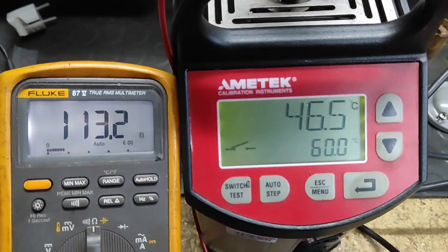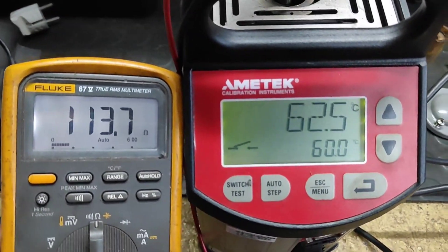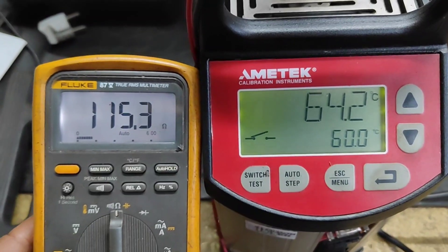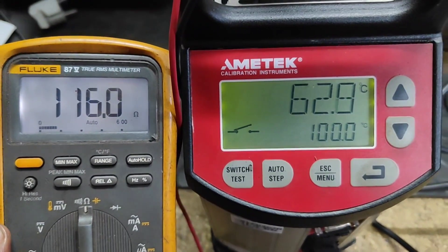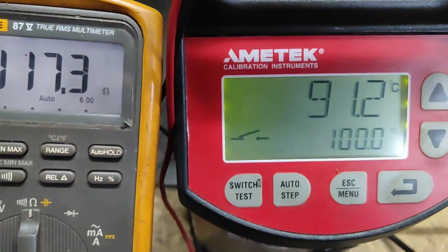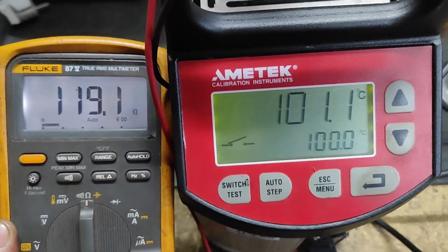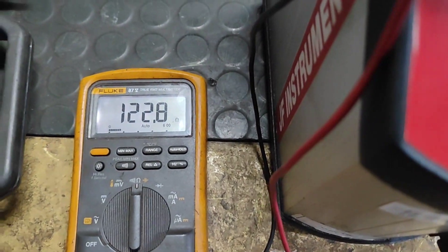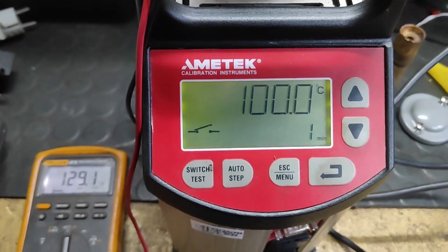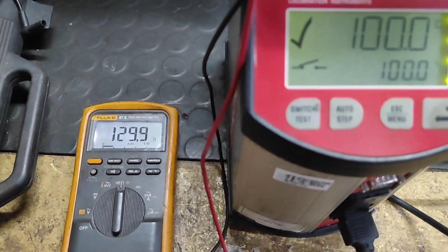Now I've changed the setting to 60 degrees Celsius and slowly our ohms value is also increasing — starting from 111, now it is 115.2. Next at 100 degrees Celsius it should be close to 138 or 139 ohms, but due to the improper connection I'll be getting close to 130 or 131. You can see it changing from 118 to 119, and once set to 100 degrees it takes about five minutes. After the countdown, the multimeter has reached 129.1 ohms. My calibrator is set to 100 degrees Celsius but the multimeter is still showing close to 130 — this is just because of the heat transfer issue between the calibrator and sensor.